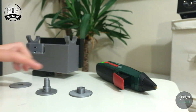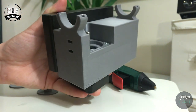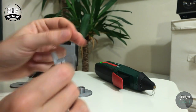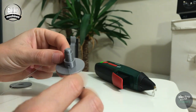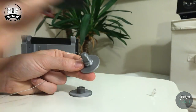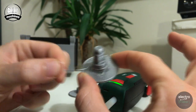For this step, you'll need the three parts of the spindle printed, the motor housing we assembled earlier, some hot melt glue, and the two ends of the loose wire. Take one piece and thread it through the lowest hole, pull it through from the other side. Take the end of the string and the first piece of the spindle, thread it through the little hole, wrap it round, and tie it in a knot — this stops it pulling back through later. Use hot melt glue to fix it in place.